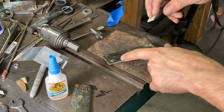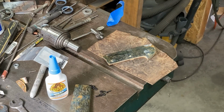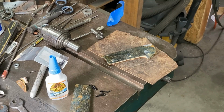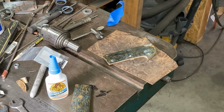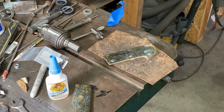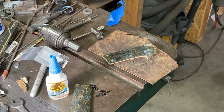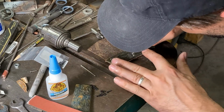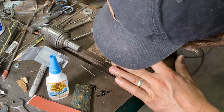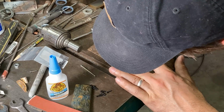Like that right there. I'm going to come at that with actually a diamond Dremel point, which I was just using, and I set it down right over here somewhere, like you do. Here's a couple of them. And then we'll just make it look less like a chip and more like just part of the bark texture of the ivory. And we're not doing this with the actual Dremel power. We're going to use this more like a sanding stick.